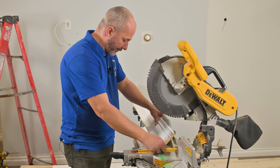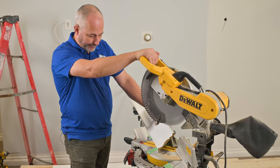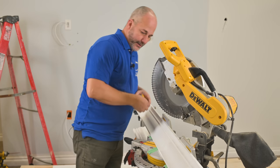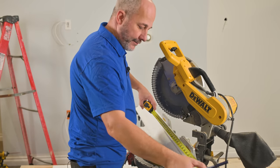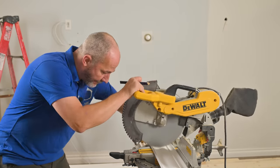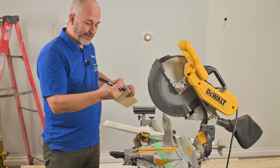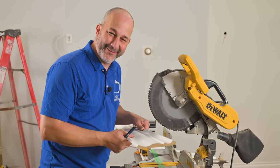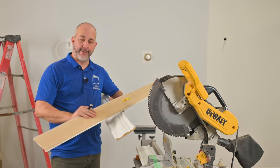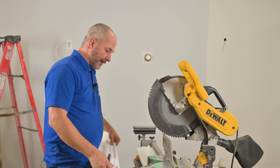So here we are. We're setting this up on the line that we've established — that's just to remember the angle. Then we're going to cut. Now that one's done. According to my calculations, we have to do a 48 cut — and this one was straight. That's about as easy as it gets. If you're doing a lot of pieces and you're going to work a saw, you can write that in or on your map you can mark them cut number one, two, three, four, five and work around the room. Do your cuts and set them aside.